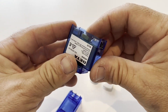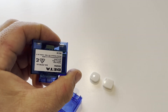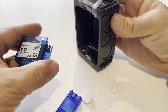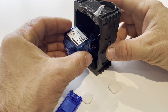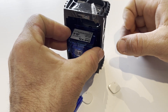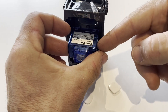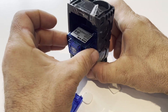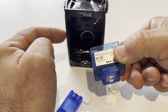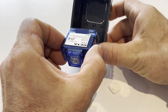One thing to note: the wires come straight out the side. If it's mounted in a masonry wall box, the wires will be sticking out to the side, but it's actually a little bit narrower than some other switches I've used so it's not a big deal. Sometimes wall boxes get deformed when installed and it may be a little tricky to fit in, but it's still totally doable to fit three in there.